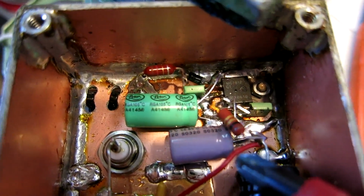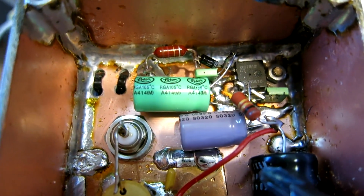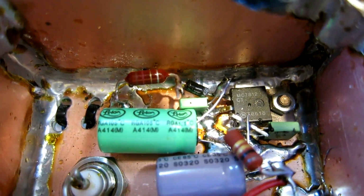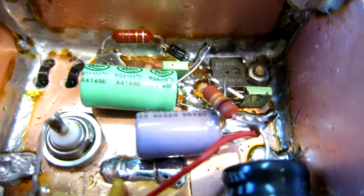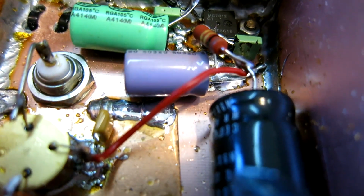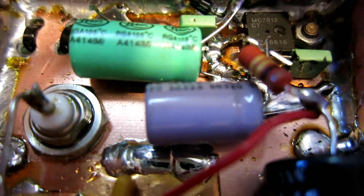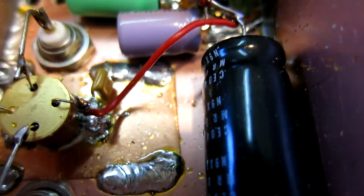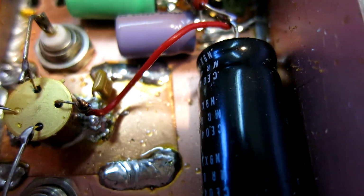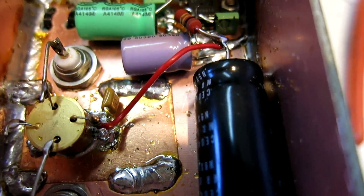And then, since I'm testing sideband noise here, I have a very well filtered supply voltage. It's a 12 volt analog regulator, 7912 I think it's called, and it is followed by a 470 microfarad capacitor, then a 1 ohm resistor, and then a 4700 microfarad capacitor. So there shouldn't be any noise in the several hundred hertz frequency region.